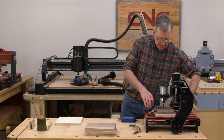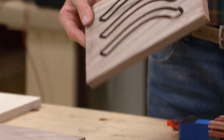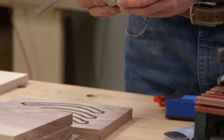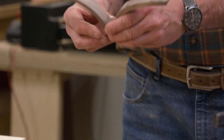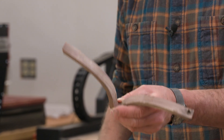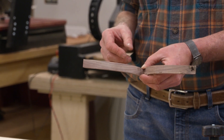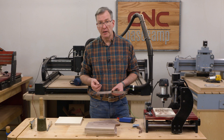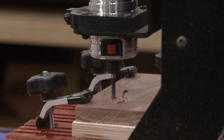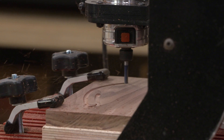Each of these pieces has been laid out for three pieces of edging, and the pieces of edging mirror each other — when they come together they'll marry each side of the petal. Creating the shape is surprisingly easy in a drawing program using a tool called the offset, which I'll talk about a little bit later on. For now I'm going to create 12 identical pieces of edging, get them cleaned up, deal with the plywood flower getting it trimmed, and we'll be all set to assemble.